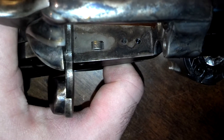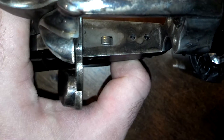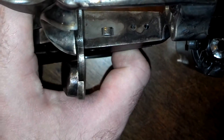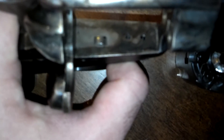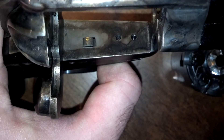It does look like it's slightly off-center, but I don't know if on the regular single action armies it's supposed to be slightly off-center. My guess would be that it's probably on the centerline normally and they just moved it ever so slightly off. But that's a pretty quick fix — simply broach it over a little bit or use some pattern files to move it, and then shim it back from the back side.